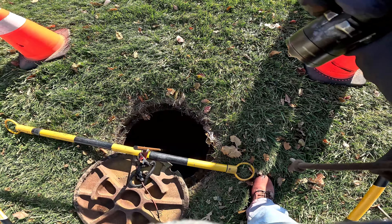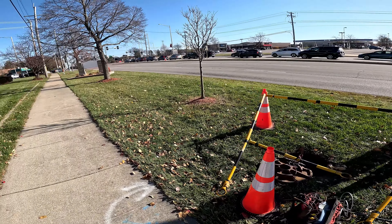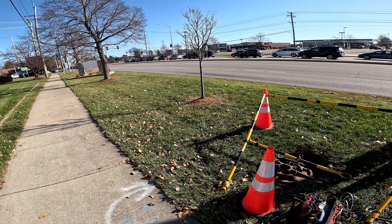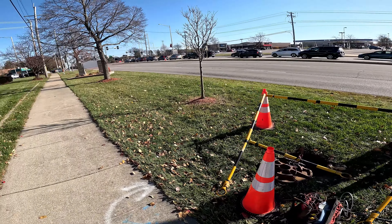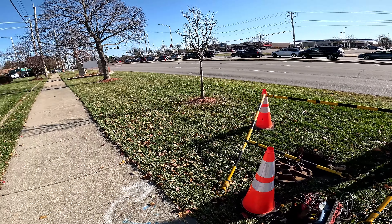The ground's tough — we need some rain. Alright, I'm going to tap it at that. I'm reading 9.8, and I only got 28 milliamps. What the hell's going on here? 28 milliamps. We'll try and trace with 28 milliamps and 9.8 locating this ductile. Hopefully I got one shot to get this right, folks, because they're doing directional boring.